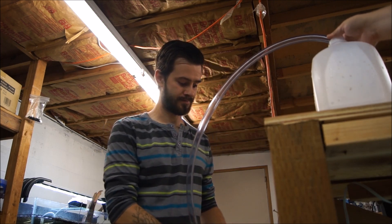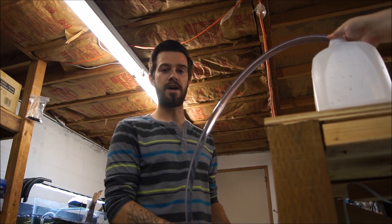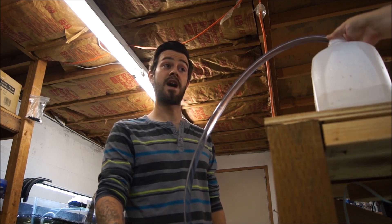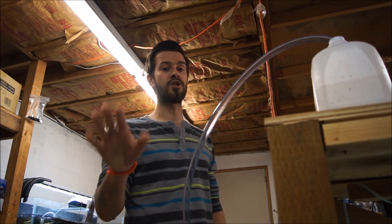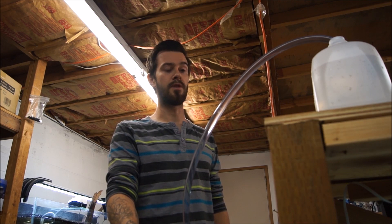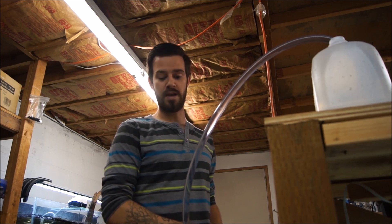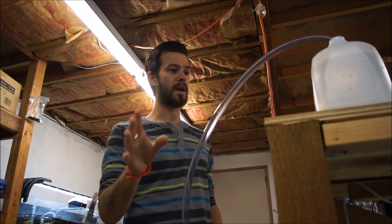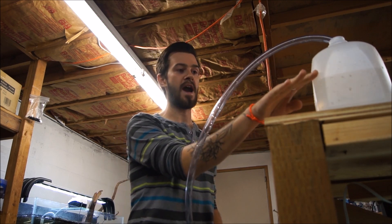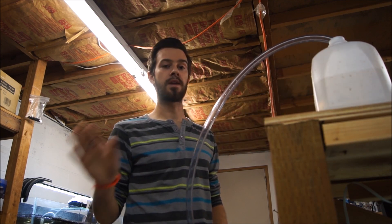Plugging it in. [Counting: one 1000... eleven 1000.] As you guys can see, it's taking a considerable amount more time to fill up this jug — about double the amount of time with just about three feet of head pressure, and we have clean water with no filter media, nothing slowing the flow. When we had no head pressure, we were almost full at about 10 seconds. So keep that in mind with your flow.